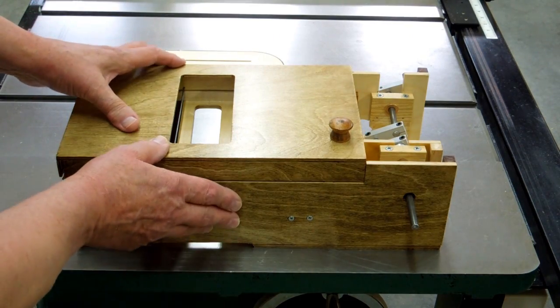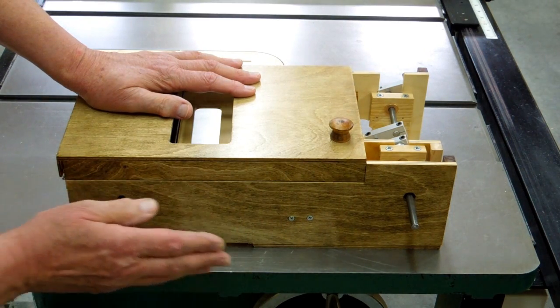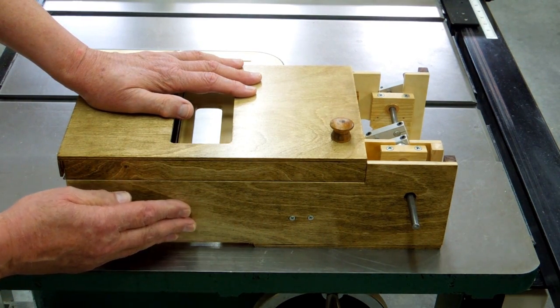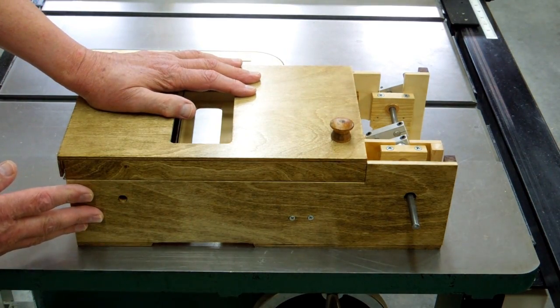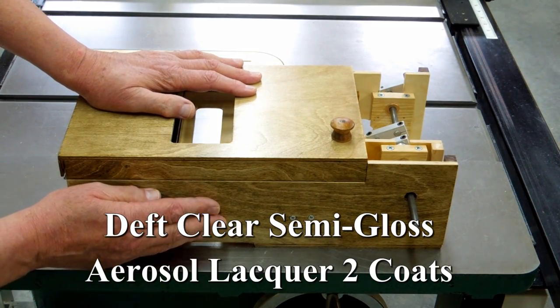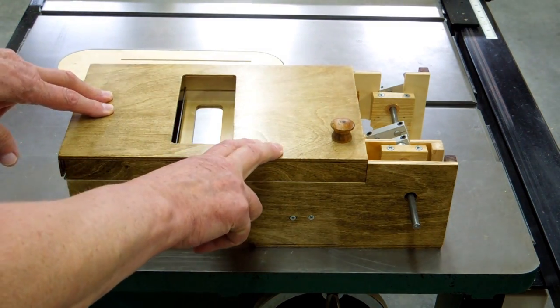I knew that was going to be a mess. So I went ahead and sanded it down and wiped it several times with lacquer thinner and acetone, then put the walnut stain on and lacquer on top of that, and it turned out fairly well. So I did the same thing on the other piece.